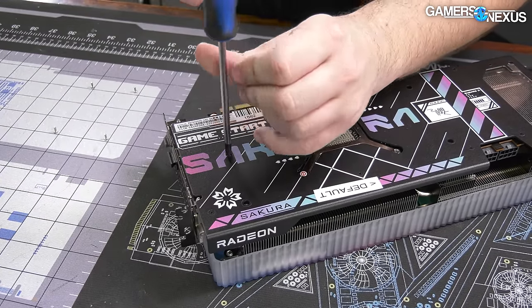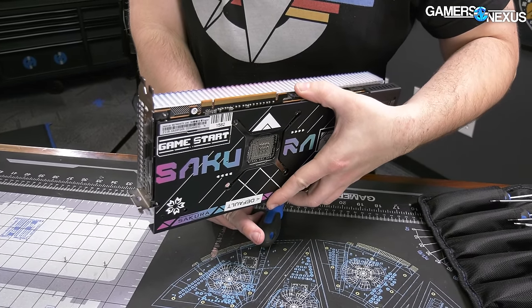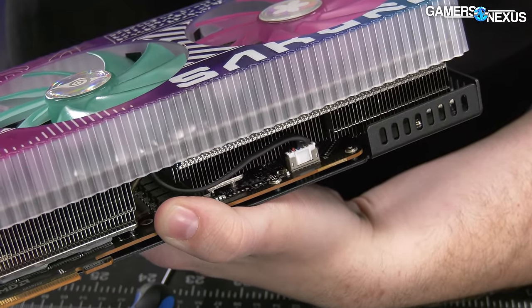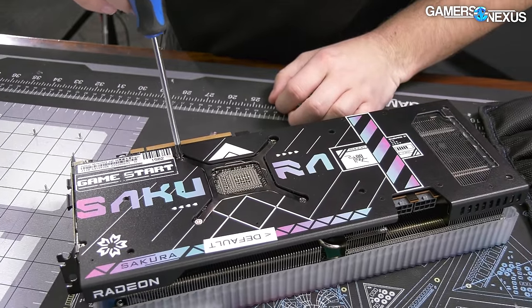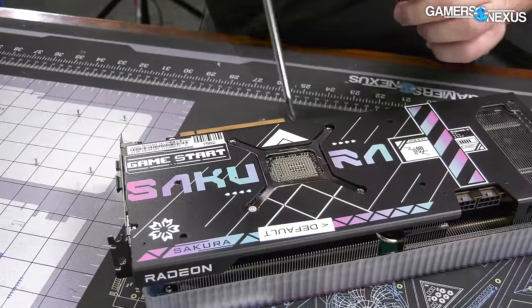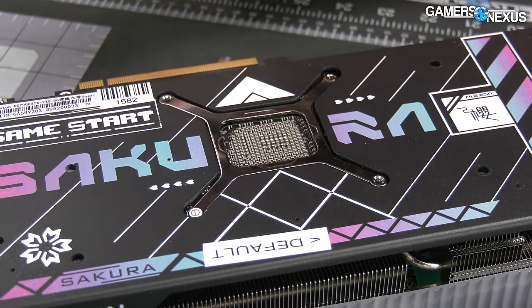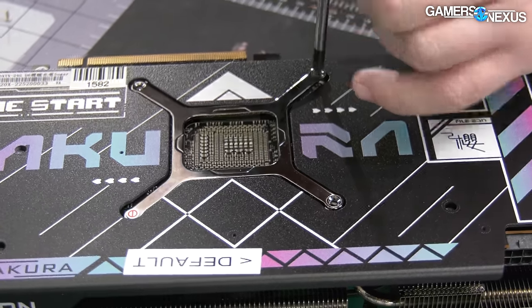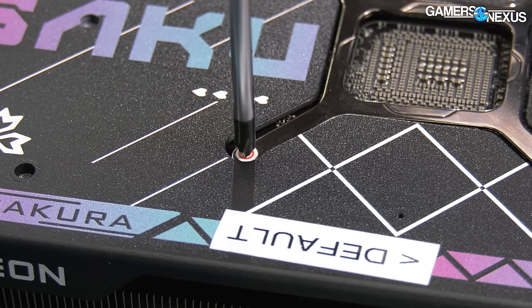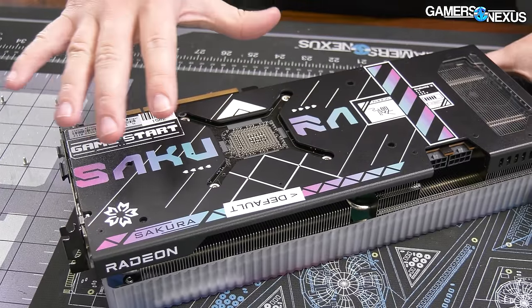So far these are all the same type of screw, which does make it a lot easier to put back together. I was hoping to just take the back plate off, but I see that there are some top side screws going through the PCB on the top and into the back plate holding it in place - so we need to take the cooler off before the back plate. They're not spring-retained either, just screws on the leaf spring with no spring on the actual screws. So we have all the screws out of the back side of the card.